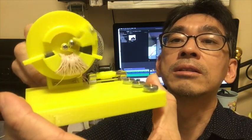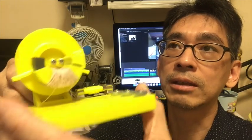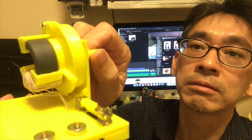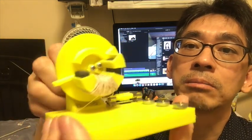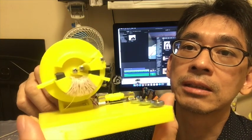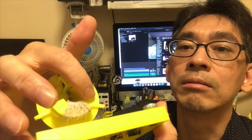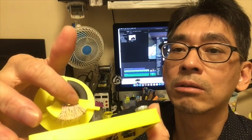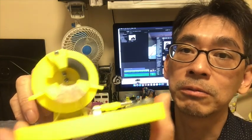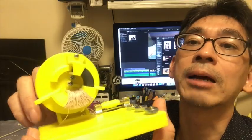the coil. The favorite ring core is the R40C1. This one is a bit thicker. It's a 15 millimeter thick ferrite core, but the size is smaller, 37 millimeter diameter. So again, the wire for the coil is wound using Litz wire, 60 times 0.04 millimeter. It will give better performance in the AM broadcast range.